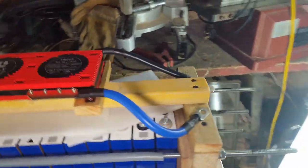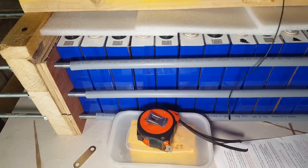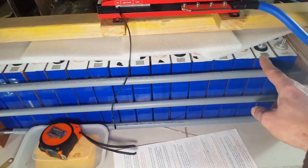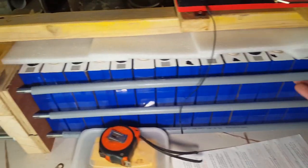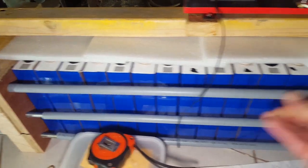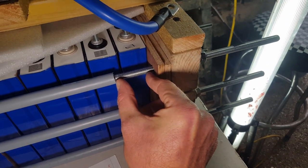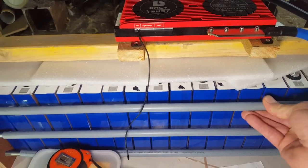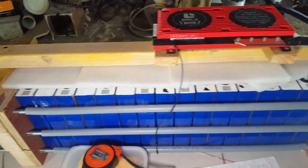So that's it so far — wound in a good distance, put some lock nuts on it. To give you an example of where I chickened out on the amount of squashing: I measured the cells at 36mm thick, multiplied that by 16, and cut some sheath so there's no shorting risk on bare metal. I could still squeeze them that much more, but I think that's excessive for the condition of the cells. I chickened out — I can get all the bus bars on and that's tickety-boo.